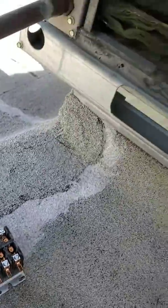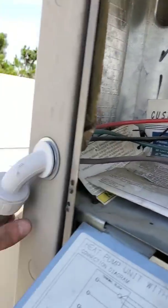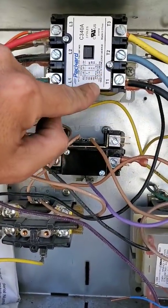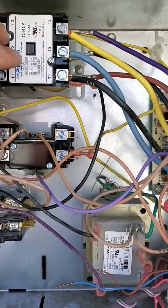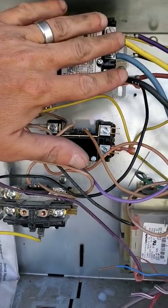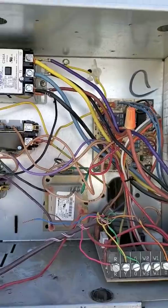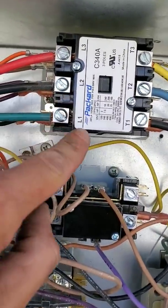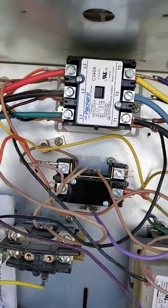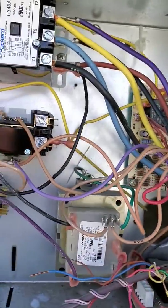On the contactor, there are L's and T's. The L is your line voltage coming from the breaker into the unit — put those wires on your line voltage terminals. The T's are your terminals for your load. Once the disconnect is on, there's already voltage at the L's. When 24 volts hits the coil, it energizes and pulls in the contactor, sending voltage through to start your fans, compressor, and indoor blower. If you make a mistake and it's swapped, just flip the cover around and it'll work the same.